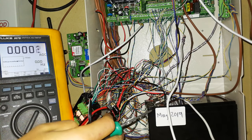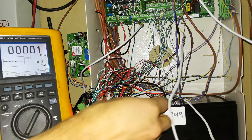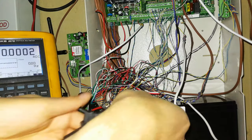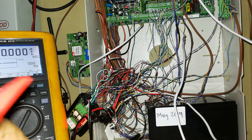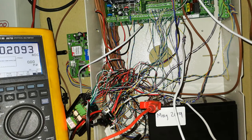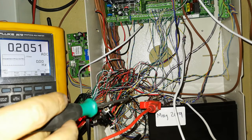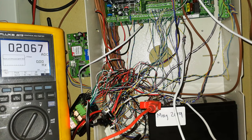If you want to test the loading on your alarm battery, do this before adding any power supplies. All you do is disconnect either the positive or negative lead, connect that to your ammeter, and connect the other lead to the battery. I'm going to switch off the mains power because the whole point is to measure the battery load when the mains is off.